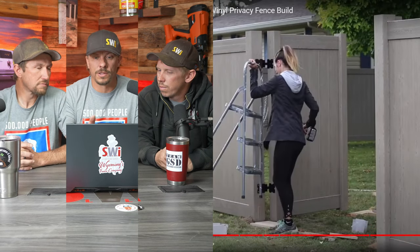What she's not telling you is on that post, she didn't fill it. Usually we would put that I-beam in the post before we stab it into the concrete so it's locked in with everything else. She obviously taped off the bottom of the post or something so that she could sit that in there later on and didn't have to cut it off. Had she filled the inside of that post with concrete, she would have run into some problems there.